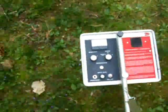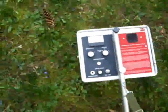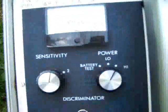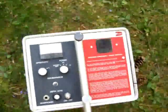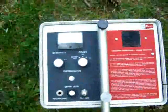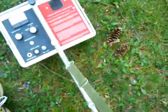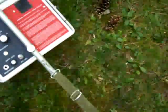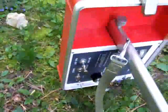Once I've established where the cable is, I can keep going a little further down. Walk again, wait for it to peak — and there it is. The camera doesn't like being close to it; that's what's causing the interference. But there's the peak right there over the cable. Here's my peak, and you can see that's where the cable is.